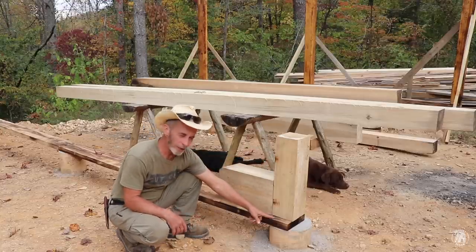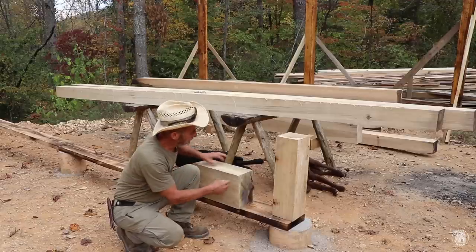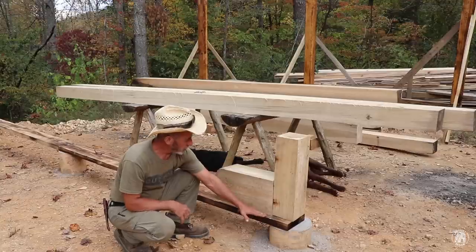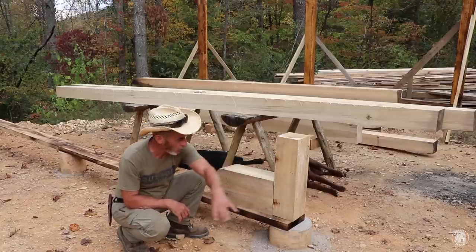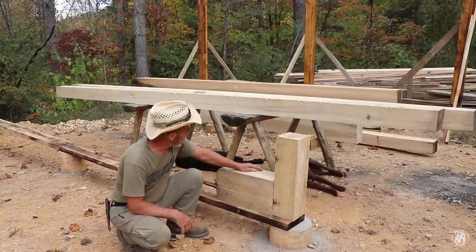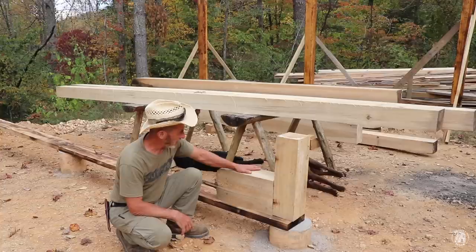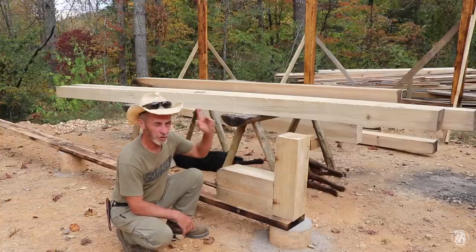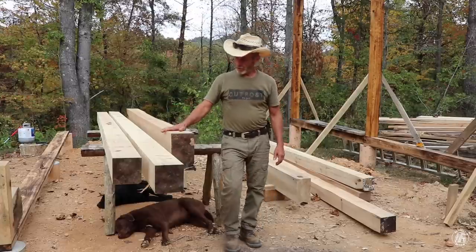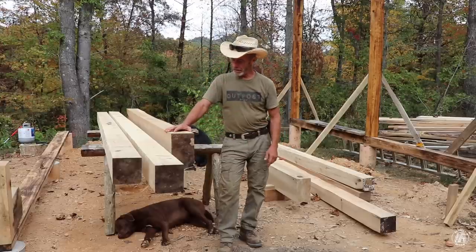So what I'm going to do instead is put the post all the way down on the column. I'll dig a mortise out of the post, cut some off the other one, make a tenon sticking out, and slide the two together. The post still sits on the column and the floor joist starts at the front wall — I think that will look a whole lot better. It wastes a little work on that mortise but there's still plenty left. I've also got another six by ten going up on the second floor, so I need to remember to put the mortise on that outside post for it.